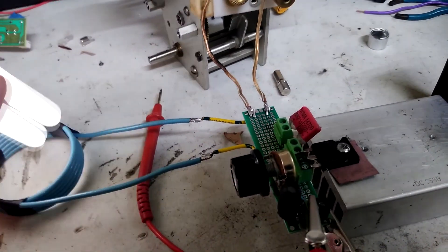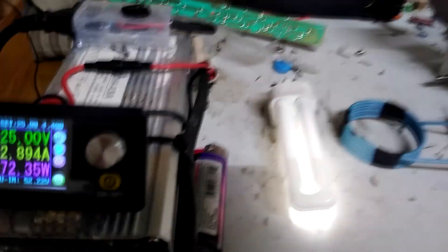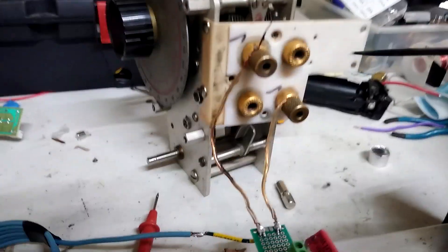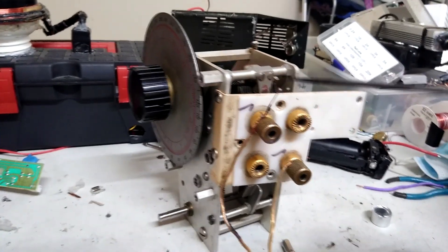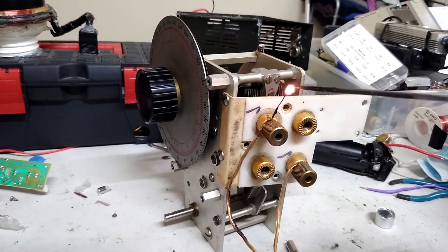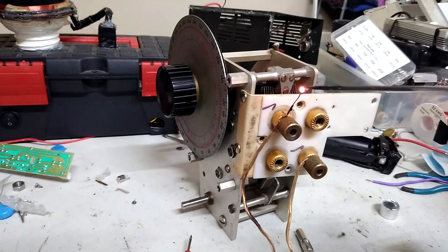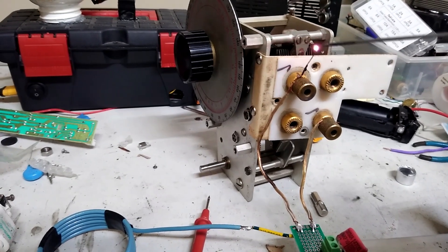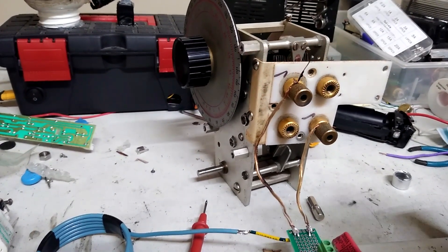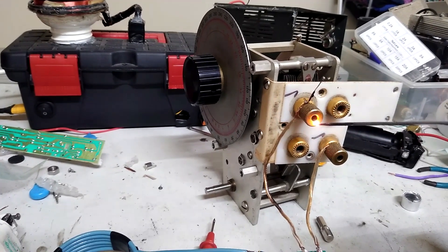You could use pretty much a whole range of different MOSFETs and it puts out quite a bit of power. In this case, roughly 72 watts or so - it's putting out a hot arc. I have reason to believe that if you crank this up high enough in voltage, and you've got a capacitor that could take it, you might even be able to pull up a steady flame just off this high leg right there. When I get too high in voltage though, these plates start discharging together - the voltage is just reaching too high and it's not able to break out. The higher I crank the voltage, the more power I'm able to pull out of there.